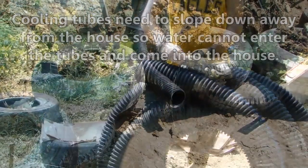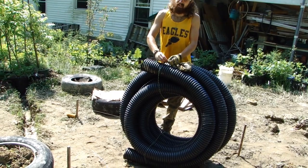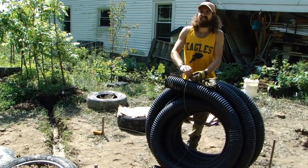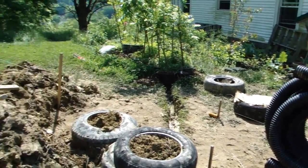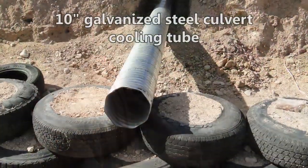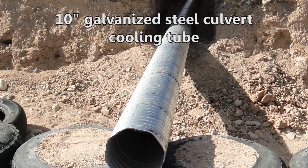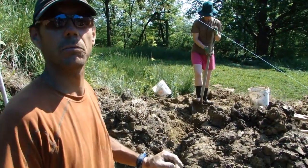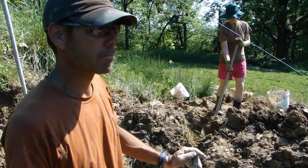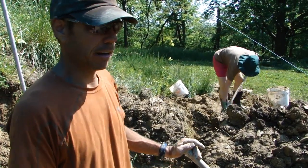That's right. That's four-inch flexible plastic tubing for venting. Can you talk about the pros and cons of using plastic versus galvanized steel? Well, with galvanized steel, the concept is that when the air is coming through the tube, it's in direct contact with the ground and it acts as a conductor, so the air is cooling as it comes through. Whereas with plastic, plastic is basically an insulator.